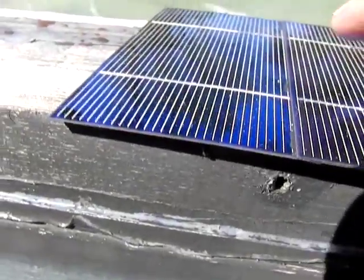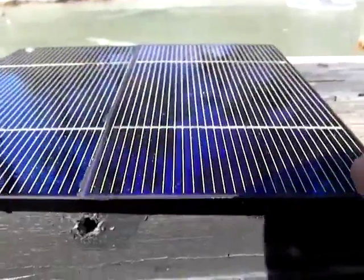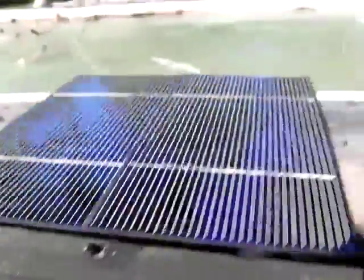In order to build your voltage or stack your voltage, you need to go back-front, back-front, back-front, just like you do with batteries. So what you do is overlap one on top of the other — this one would be on top of the next one and you cover a little bit of the cell. You do lose a little bit of that area.